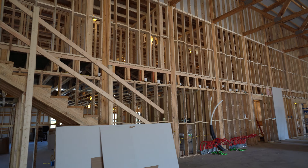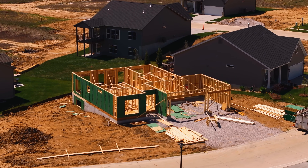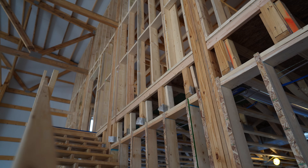Those are some of the unique differences, then when you flip to stick frame. Stick frame is generally categorized as stud walls — two by four, maybe two by six studs — that make up your wall, anywhere from 16 inches to 24 inches on center. So it's a lot more iterative. If you think about house construction, that's the visual to have — those walls getting put up with all stud frame, 16 inch on center studs, which is probably the most common. And then your truss system is a similar spacing, somewhere between 16 to 24 inches on center.